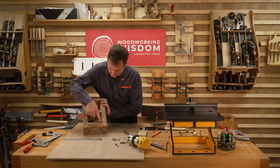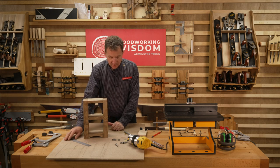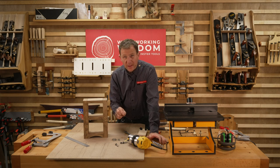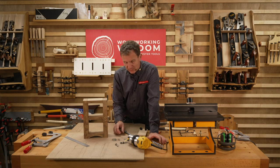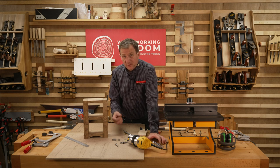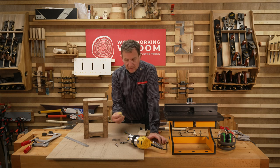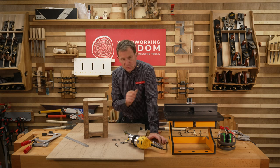So, having glued up a little bit to the bottom, at the moment everything else is dry, so don't go gluing up yet. Just changing the router cutter, so we're going to do the slot and the groove all the way around that's going to hold the brass and the wooden insert in the front of this. So we're taking the milling cutter out, we're going to use a slot cutter, one of my favourite types of cutters. If we went with a straight cutter, 2mm thick, 5mm deep in oak, I bet you'd snap it. So we can go with something like a little circular saw blade, a lot more inherent strength in that than a straight cutter. Okay, so we're going to set that up, going to use that on the small table to do the grooves.